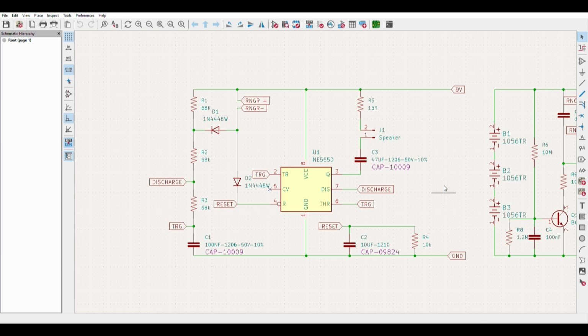So with the way this circuit works, once the battery saver circuit has been engaged to provide power to the Ding Dong Doorbell, when you press the button, C1 charges via D1, and also charges via R2 and R3, but it also shorts out R1 here. The result of doing this causes what we call a click to go through the speaker, which happens very quickly. It's not perceptible, but it happens so many times per second you get an audible tone.